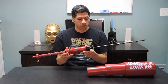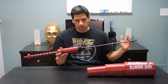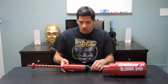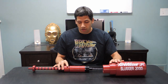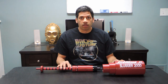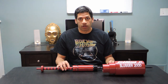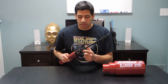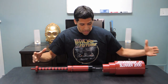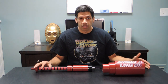The other key part about this design deals with the latching of the gas spring — basically, how do we overcome the 25-pound force of this specific gas spring in order to keep the piston in and keep the bat compressed. And the way we deal with that is with magnets. There are four locations of magnets in the bat: two sets on the handle and two sets in the telescoping section. The first pair of magnets deals with keeping the bat compressed, basically having to overcome the 25-pound force that is always wanting to keep the gas spring open. That first ring is right here around the ring on the handle, and there's a corresponding ring at the bottom of the largest section of the telescoping part. When the bat is compressed, these two pairs meet, latch together, and provide enough force to overcome the gas spring wanting to open, holding the bat closed.